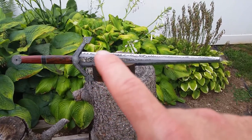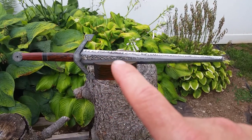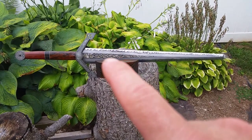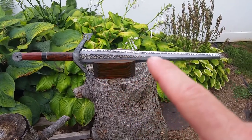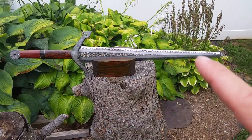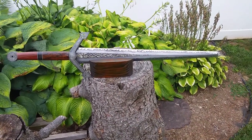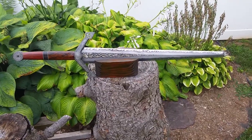In this area here I did put in a fuller in the middle and then put the rock pattern in there, and it measures about 0.285 to 0.290, so I did thin it out a little by putting in the bevels and the fuller. It thins out to about a quarter inch down here, so it is tapered both in the width of the blade as well as the thickness — it's got a nice taper to it.